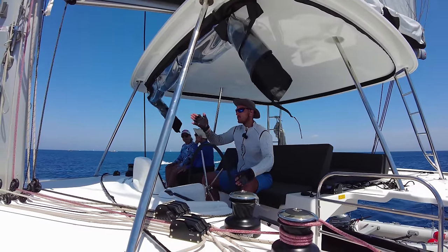We're sailing beautifully, and down there, there's a boat coming, on a collision course. They have no sails, they are on power, so of course we have to give way. But don't forget the rule, you have to do everything to prevent collision. That guy might be sleeping, drinking beer, or he fell in the water, or has no clue what he's doing, so even though we're sailing, you want to keep an eye on them. There's loads of kinds of people sailing around, so you have to think about yourself. Don't count on everybody seeing you.